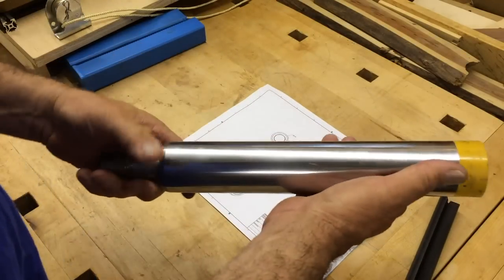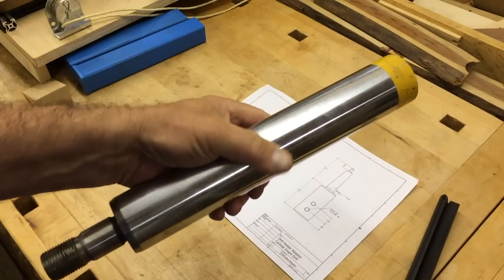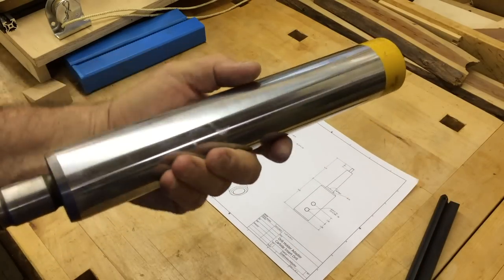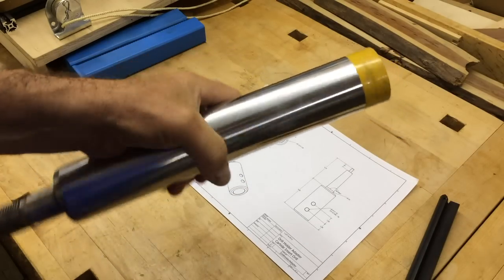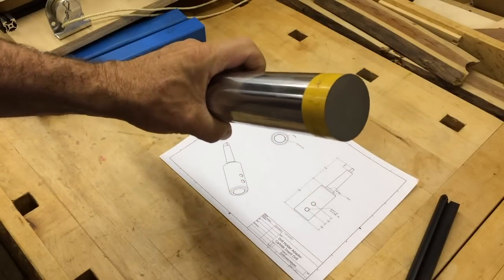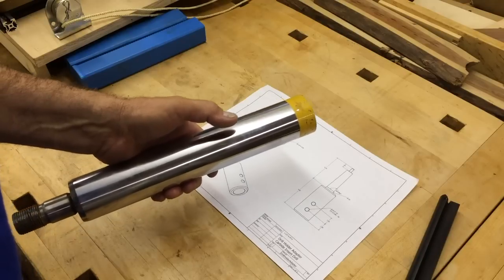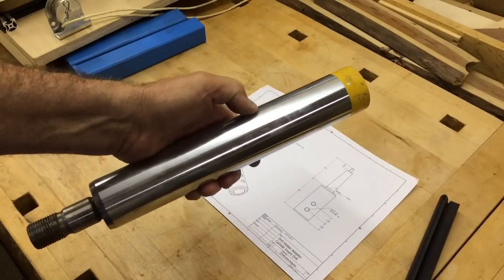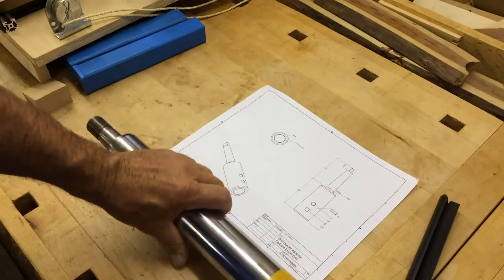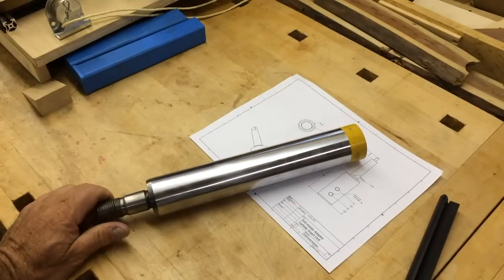And I'm going to be using this hydraulic cylinder scrap rod. I've already whacked off the clevis end on it. It's chrome rod, probably 1045. I guess that's what most of these are made out of. Pretty nice chunk of steel. I'll need just a little over 8.5 inches to make this, so I'll use most of this up, and it'll be a pretty nice little tool. So that's what we're going to use there.